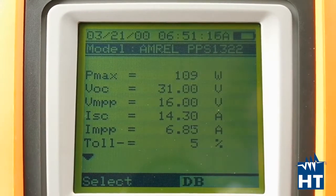Here you can find all the modules stored in the memory of this IV400W. As mentioned, we have 30,000 modules in our database in our Top View software, which is included in the package. We can use this module database to download up to 30 modules into the IV400. If you don't find your module in the database, you can easily add it manually on the field — just read the data on the plate of the module and add it into the instrument.